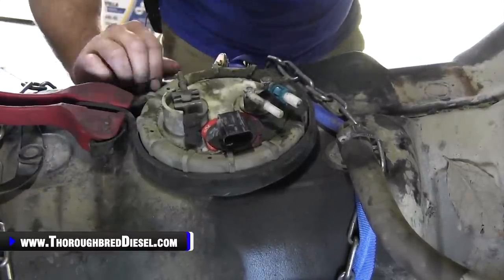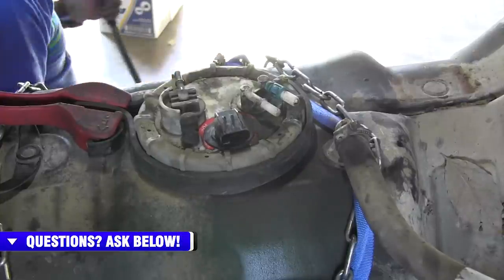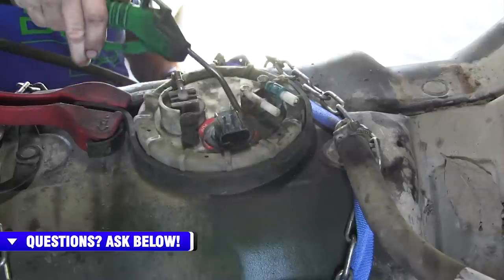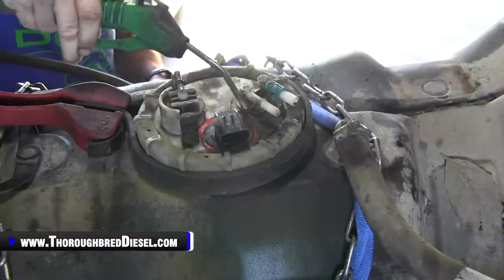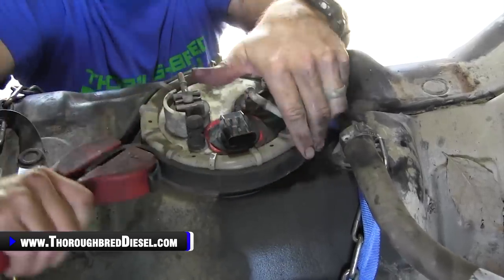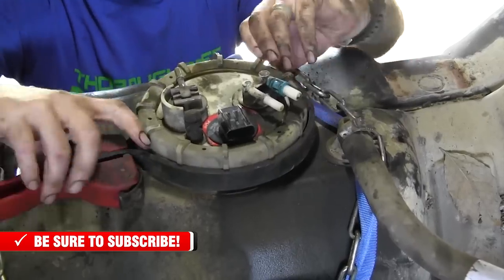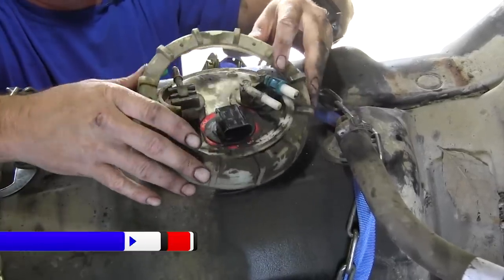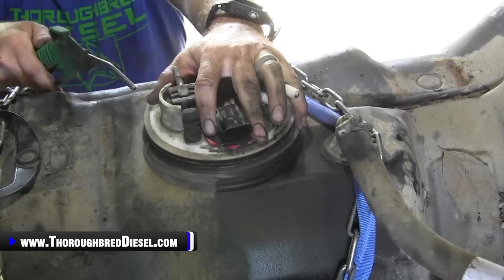For the locking rings on the tanks, I use just a big strap wrench to pop them loose. I like to have a blower nozzle handy. Once I've got it loosened up, I'll go ahead and use compressed air to clean out around this so I don't have to worry about dropping debris into the fuel tank. You can do that as you're loosening up the collar too — when the collar loosens up, that's when the most dirt really gets wedged loose. Spin the collar off the tank completely, then use the nozzle one more time before lifting the sending unit out.